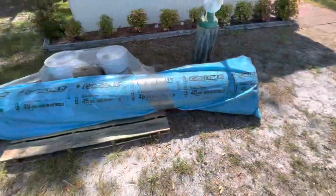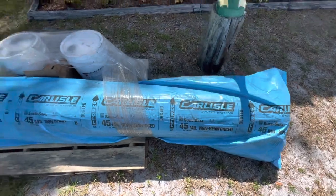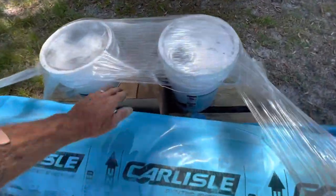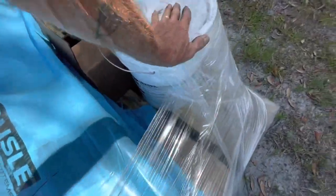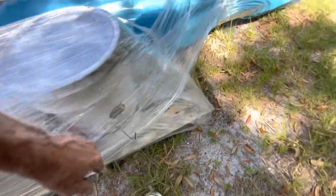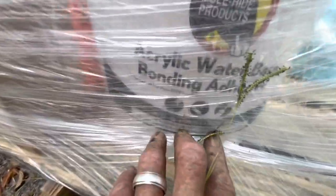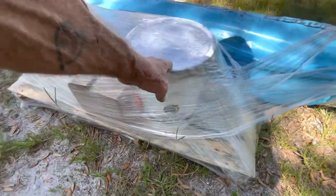I'll see you tomorrow. When I upload the next video, hit that bell notification so you're notified when it's coming. This is some of my material — I used Carlisle 45 mil non-reinforced, termination screws for the outside metal. And this is what you want to use for glue if you're gluing down to the metal or OSB or whatever: acrylic water-based bonding adhesive, $230 per bucket.